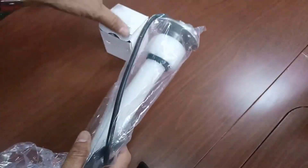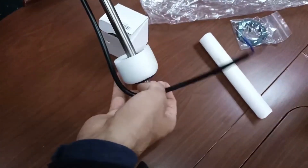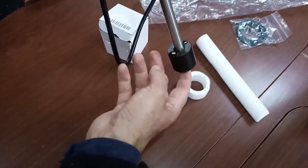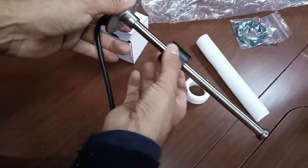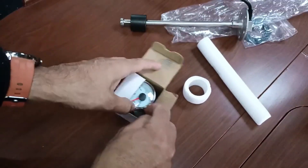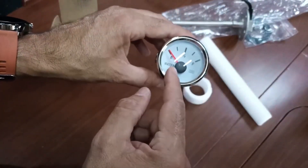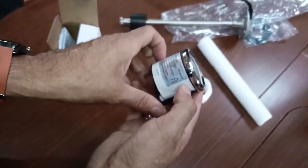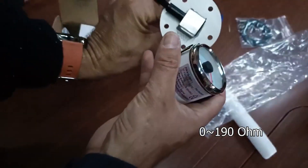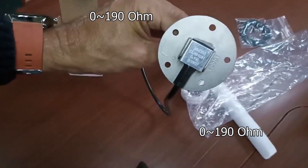The level sensor comes quite protected, with an installation gasket and five stainless steel screws. It looks very good — it seems to be of good quality and all the finishing is in stainless steel. The only moving part is the float, which with the level of the liquid will move between its maximum and minimum position, indicating the filling level at all times. We also have a small box with the gauge clock, available in different graphics and colors for water, fuel, etc. The critical thing is that if we have bought the sensor in the 0–190 ohm standard, the indicator must also correspond to the same standard, as you can see on the label. In the end I have one of each type because of my first purchase mistake, but as they are independent, each one works with its partner.